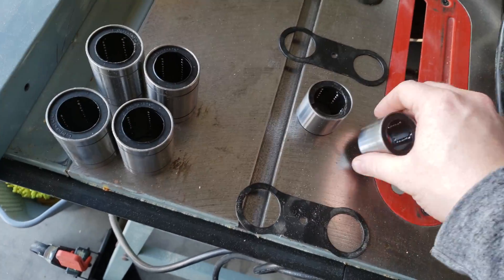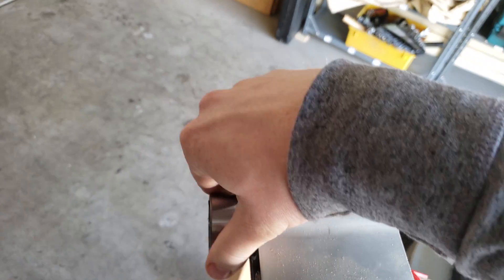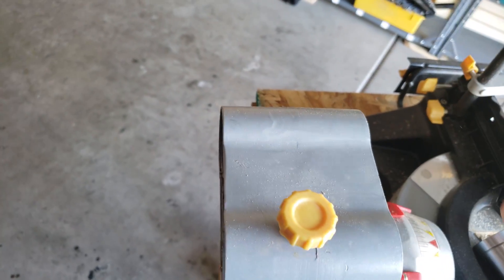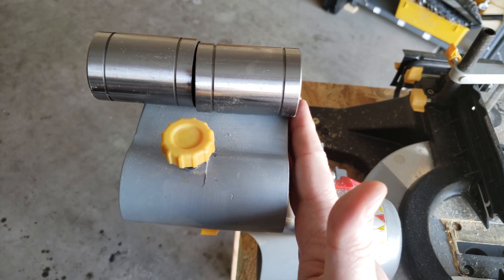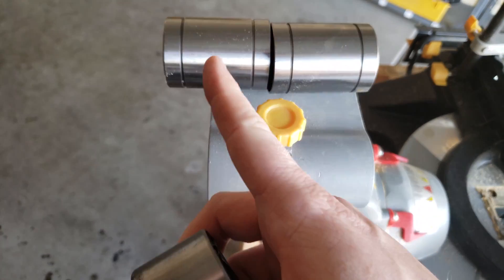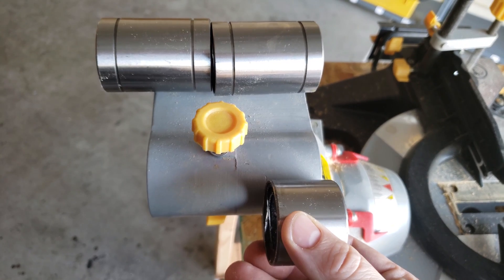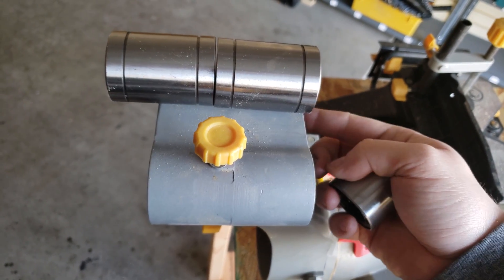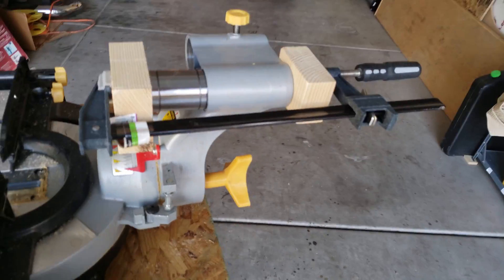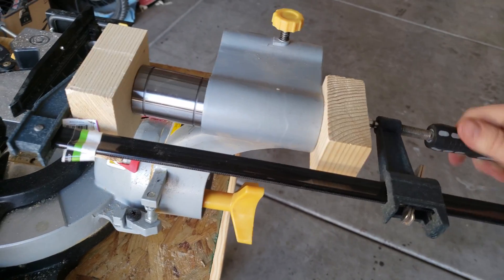The new ones are also LM30 UUs and they're all about 65 millimeters, which is interesting. So what we're going to do is take out the existing bearings and put these new ones in. They'll stick out a little bit, but the theory is that's actually going to help get more rigidity in the arm. We'll go from having one small and two small bearings on one side to two full sets on both sides. I'm going to get a piece of wood and some clamps and see if I can press these in.